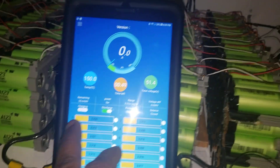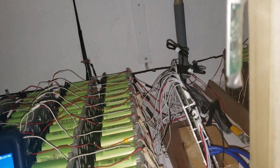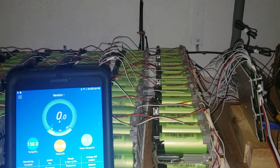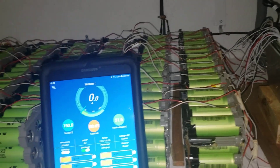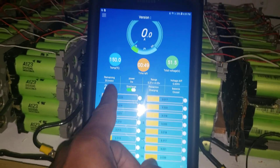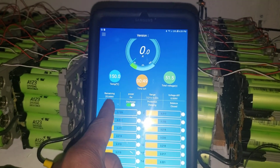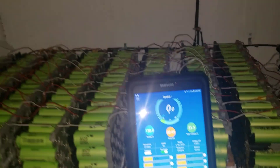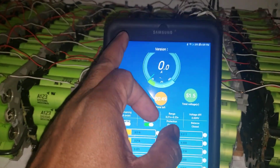Now what I have here is this thing wasn't charging and it wasn't discharging, so I didn't have any light. I had some issues because somewhere it wasn't picking up all the cells, so it's stopping the charging. I don't know why it's dropping charge - everything looks perfect, there shouldn't be a problem. Maybe the temperature - I'm not sure why it's not charging. Let's check the parameters.